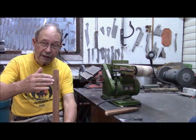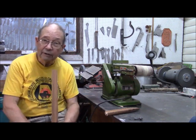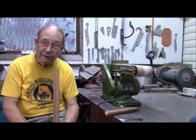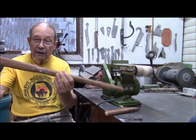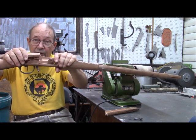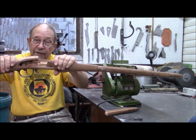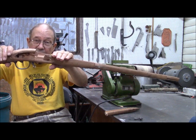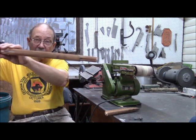To get this precision cut from here to here, we have this flatbed sander mounted on my work table in my shop. There is a problem though — the vice on the corner of the table is much too low. In order to have the gun pivot as I grind, I'm fortunate in having some holes already drilled through here, and I have an appropriate size nut and bolt that I can fit through it. So if I can build something to elevate the gun, then I can pivot on top of the flatbed sander and maintain that angle, which would be very difficult to do free-holding this gun because of its very long length.